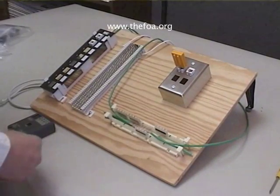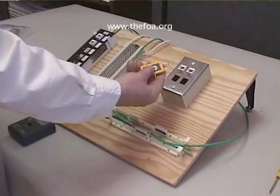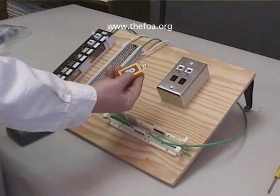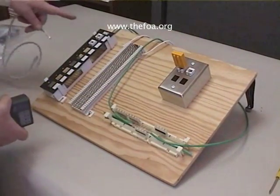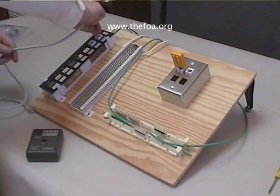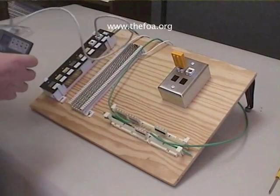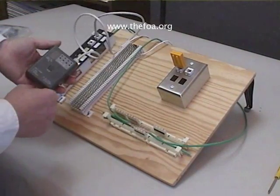This is just what you do in the real world. You would go to the work area outlet and plug in this terminator, knowing the number — and you have a number of these, up to eight of them. Then you go to the patch panel, plug a cable into the jack in the patch panel. This is a standard Category 5 cable, which you'll find two of in your supplies. Plug that into your wire mapper.